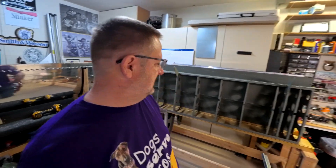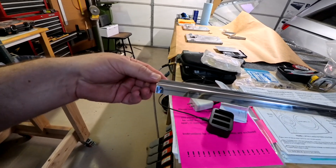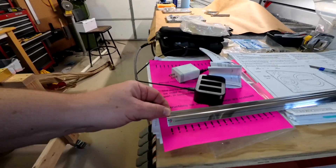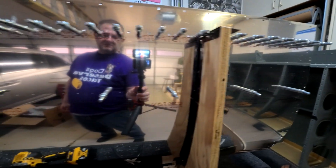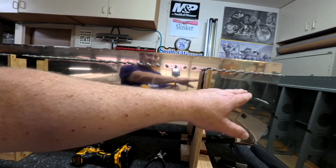Because I was not careful when I was doing the J-channels for the wings — be careful which ones you cut, because you do get enough, but if you cut the wrong ones you won't have enough for the tanks. So I had to order more, and now I have them. The first thing you have to do is mark and drill that first hole, then draw a line down the middle so you can see the line through the holes. It should go through the middle of all the holes, and then you drill every so often to line up that line so the J-channel goes straight across. Then you just drill out the holes. That's pretty much what I've been working on for the right wing.